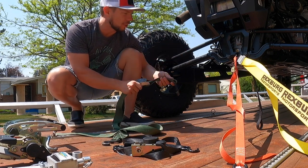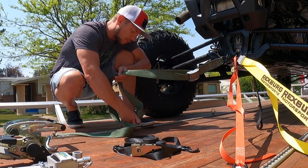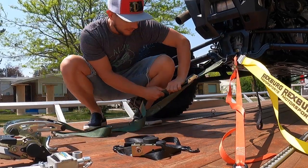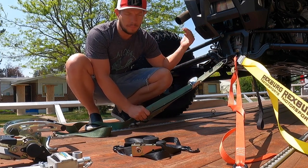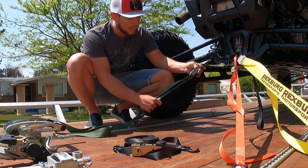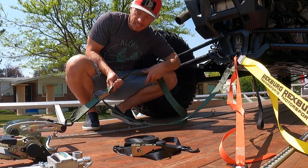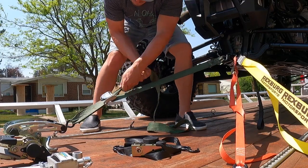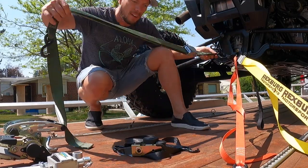With these pull-type straps I have a system built in. I like to make sure I can get a good pull on it because if I can't, I'm never going to get it tight enough. I put it between my two tie down points and then I cinch — but as you can tell, there's not really the greatest way to tie that down. It's never going to get much tighter than that, and if this machine flexes at all this will come undone real easy. I like to set these ones and then ratchet to the front so it puts a lot more tension on it. It's a simple style — cheaper, not the most secure, but it will work if you counteract against them. Something to keep in mind is where you put this buckle: if I put it up here I'm pulling this way, and if I put it down here I'm pulling this way — sometimes you can get a little more leverage. They're not my favorite but they're simple and cheap.